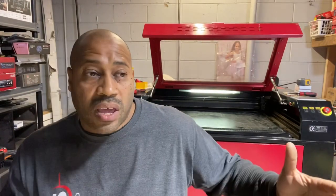Factor in the price of the machine, the price of the chiller, and making yourself a nice stand so everything can go together. The chiller is sitting behind the machine right now — I want to make a rack for it so it can sit next to the machine and I can keep an eye on the temperature while it's cutting. And then there's the air assist pump; the pump they send is sufficient and works really well, but I want to make a solid rubber mount for it because sitting on top of or inside the machine it makes a ton of noise.